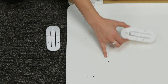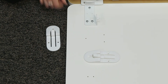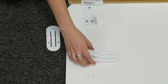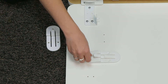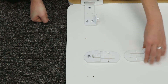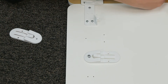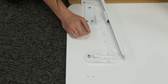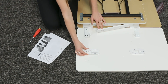There are two sets of holes that the shims could fit on. The reason there are two is because the extension is universal to either side of your table. Because we're putting it on the right side, we want to put the plastic shims further away from the hinge clips. Line those up and take your screws and screw them in. Place these symmetrically, not in the same direction — because when we open our hinge assembly, these are going to snap and hold it in place, so orient each shim in the direction its corresponding side swings.